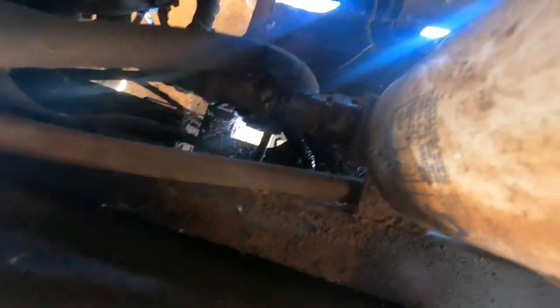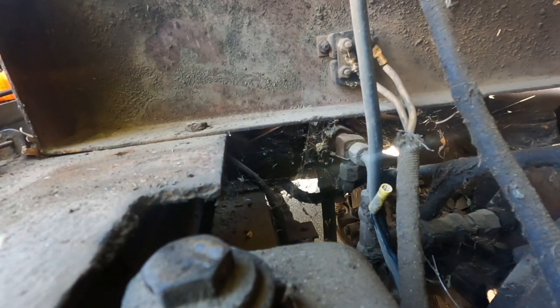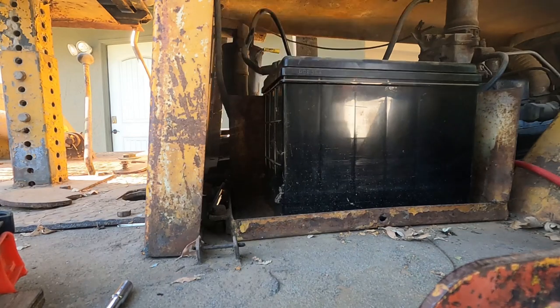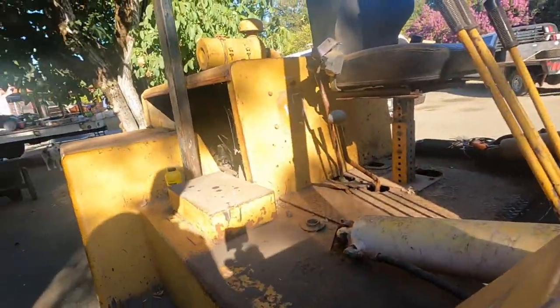So I started kind of screwing around with stuff. Here's my fuel line. You guys see how much fuel? I don't know if you can see it there. It's covering that, puking out fuel right there. So I've got to figure out where that enters. Oh, it doesn't help when the hose clamp's not even connected. Hopefully that was my issue, and that's why it always loses its prime, with the pops and sputters and hiccups. How easy would that be?